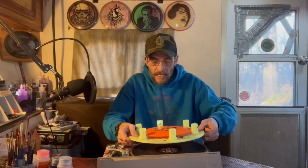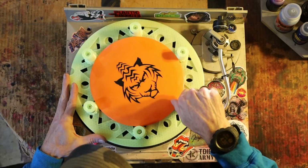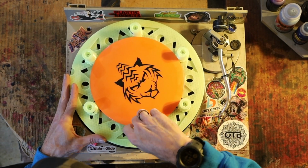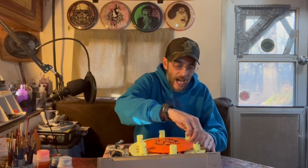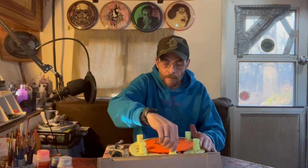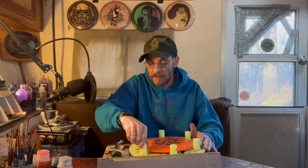And then you want to tighten this thing nice and snug, and once it's in there nice and snug, twist the pegs like this, and then what it's doing is tightening the nut and the bolt inside. And those two things are squeezing the two kaleidoscope shaped discs together and locking it into position and holding your disc now in that perfectly centered position inside the chuck.